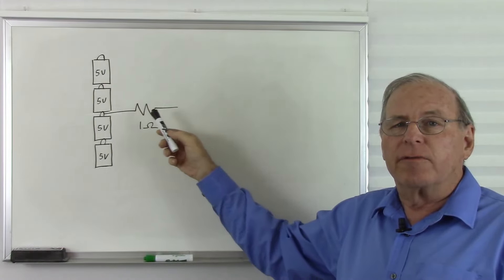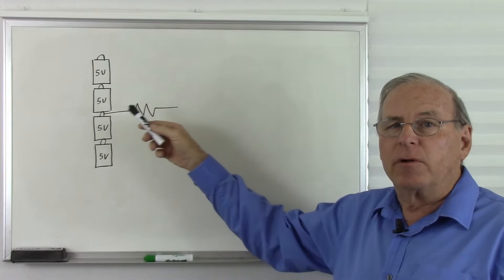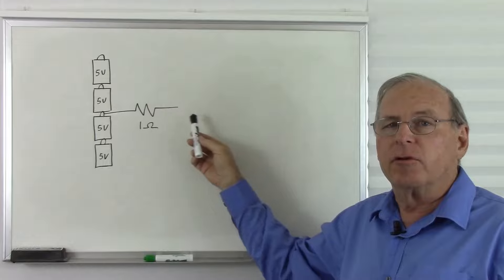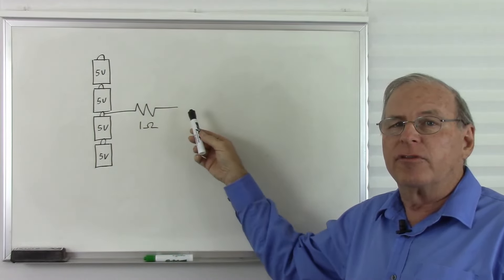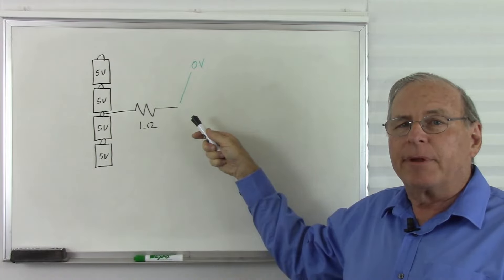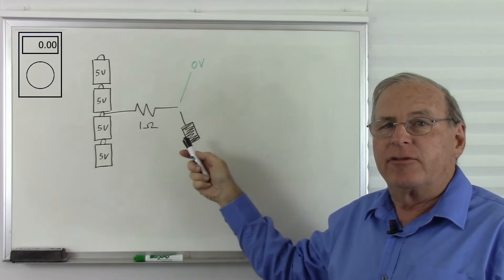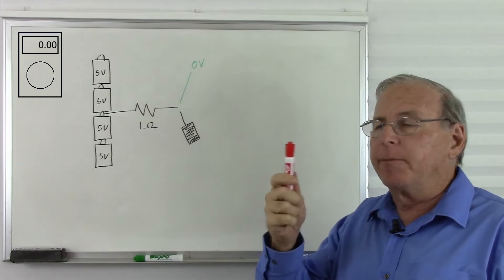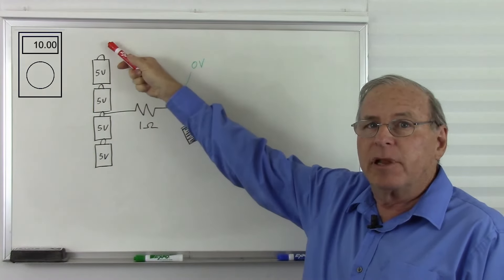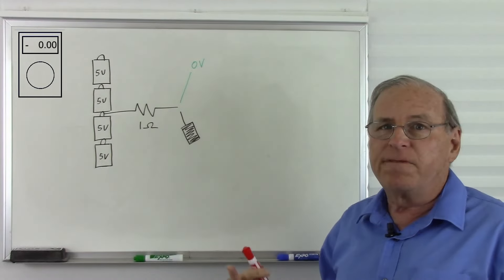Let's assume that for now there is no current flowing through this resistor. For there to be a voltage difference, we must have resistance and current. So if there's no current flowing through here, there's no voltage difference. So if this is 0 volts, this is also 0 volts. If I put my probe here by mistake, I have anchored my black probe at this point, but with no current it shows 0 volts. So when I measure my voltages with my red probe, everything should be normal: 0 volts, plus 5, plus 10, minus 5, minus 10. No problem — that seems to be working fine as a ground.